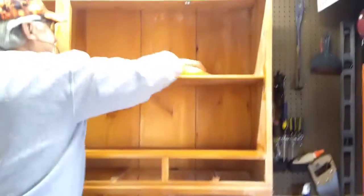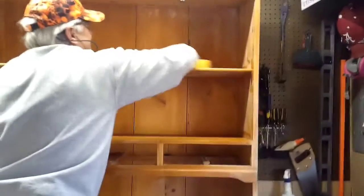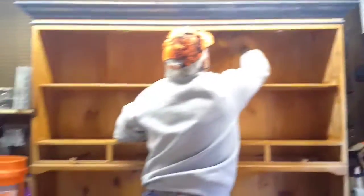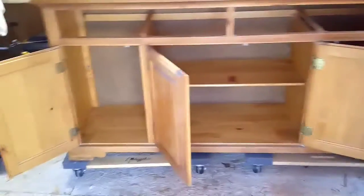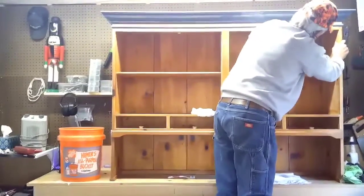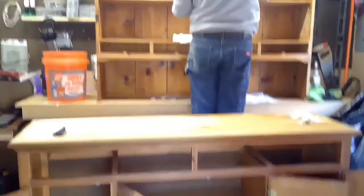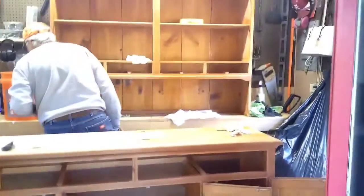Van's actually helping me right now — I'm showing him contributing to the project at hand, which is a big project. You think, we'll get a hutch and a chair and tables, sand it down, get the varnish off, and paint it to make it brand new — oh, that's nothing! It's a very time-consuming job. We've been working on this off and on for two weeks already and we're still not at the painting stage, because of the cleaning it needed and the little repairs — some of the drawers' backs were split, so they had to be glued and clamped and dried.